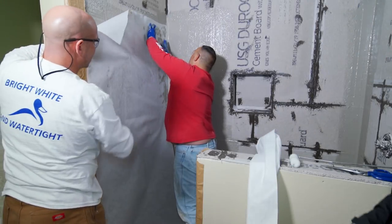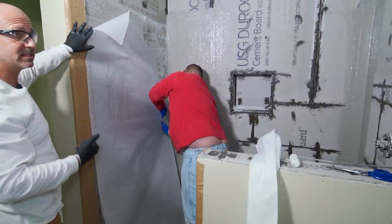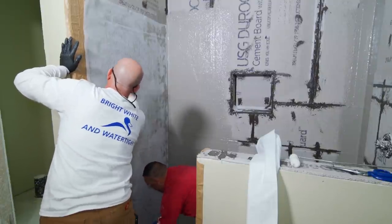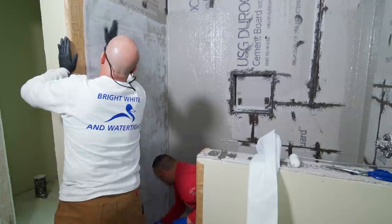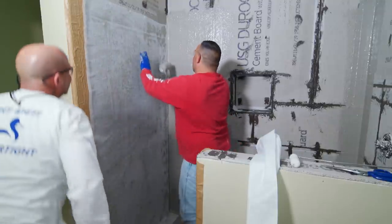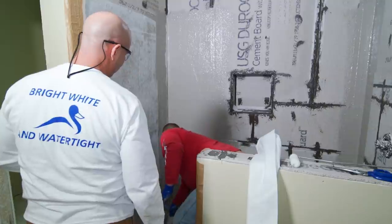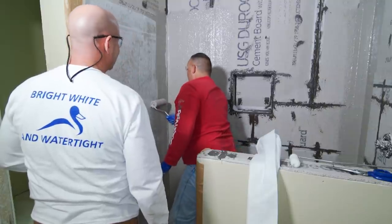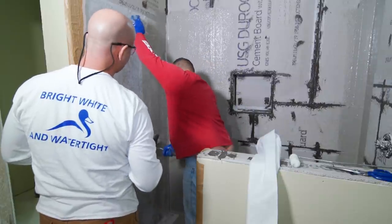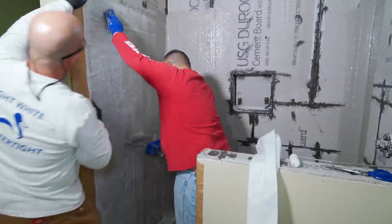Later, when he's got all this saturated and done moving the fleece with any stretching it's got, then trim it. Not a lot of pressure — all I want is to make sure it's sticking into that resin nice and straight, with less chance of wrinkles. You'll work it all in with your roller. Flatten her out real quick with some good fast passes. If you ever notice you put a dryer roller on it and it pulls anything, go ahead and soak it up. Your main goal is to saturate the bottom and flatten it out with nice fast passes to make sure you've got it placed where you need it. Make sure those edges are stuck.